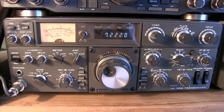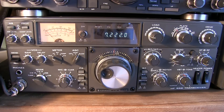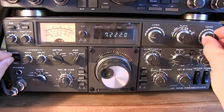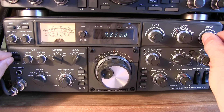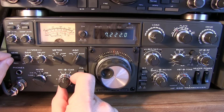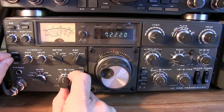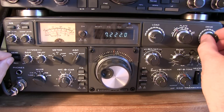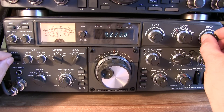This is the starting point for the tuning procedure. The first step is to adjust the drive control. With one hand on the send-receive switch, flip it to send and adjust the drive control for a maximum reading — the meter scale doesn't matter, you're just looking for a maximum. If that maximum reading is outside the ALC scale, adjust it down. I like going between half and two-thirds of the way up the ALC scale, and re-peak the drive control to be sure you're peaked.